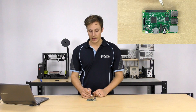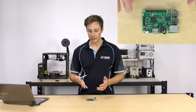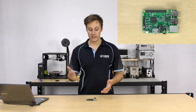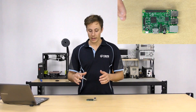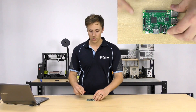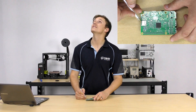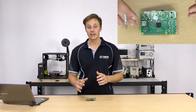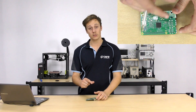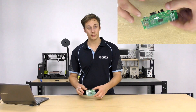You can also get access to the low-level peripherals like I2C and SPI buses. The awesome thing about the Raspberry Pi is you don't need a computer to get started — you don't need to program it with another computer. It's self-contained, and all the storage is through this micro SD port, which you can see on your screen. The micro SD card contains the operating system, your files, everything. You can swap SD cards onto different boards and it'll work exactly the same, which is pretty cool.